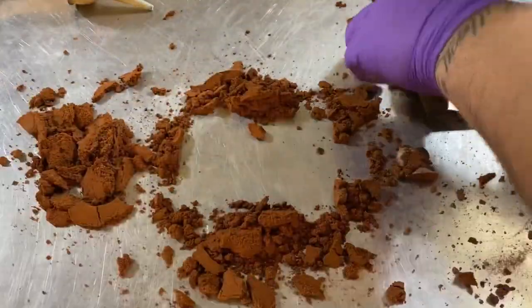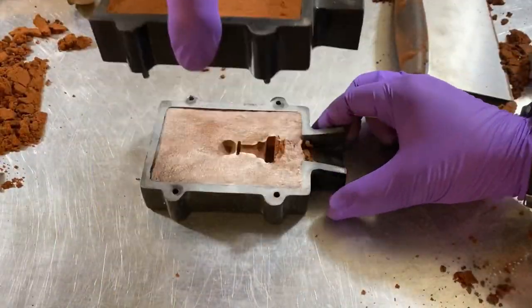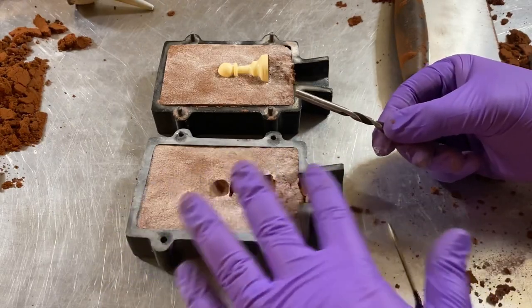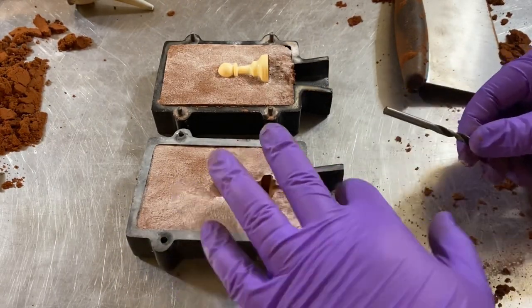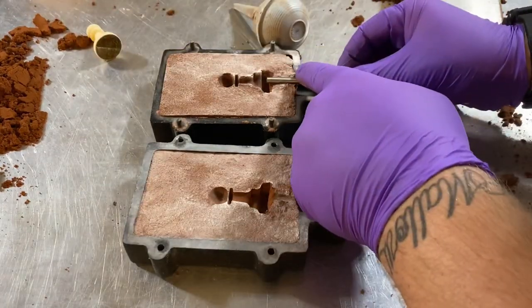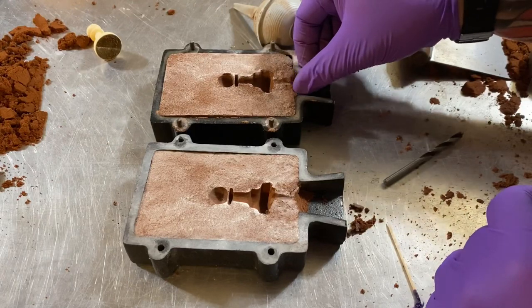After that's done, we can move this to the side and then break it apart to see how it looks. This is looking really good. You just want to make sure both halves are complete. The next step is to make a channel for the metal to flow into — I'm using the back half of a drill bit. Take your time with this; there's no sense in rushing and ruining the mold. When pulling out the piece, just pull it straight up, and if any spots start to collapse, try to fix them with your fingers.